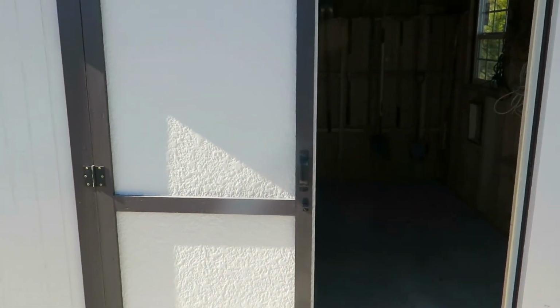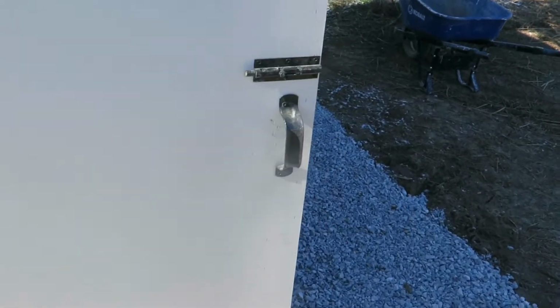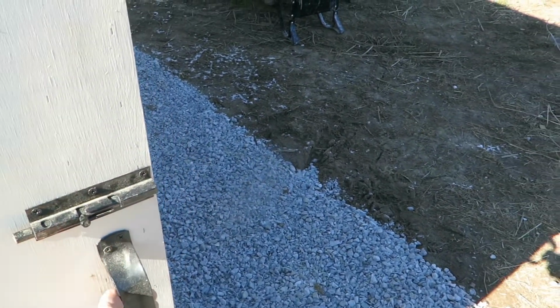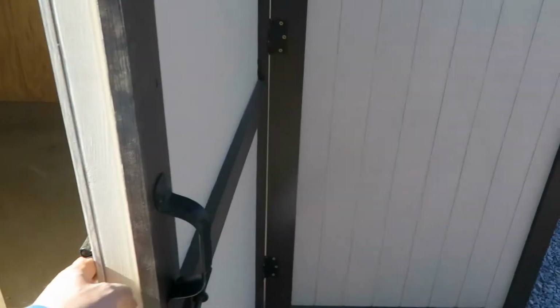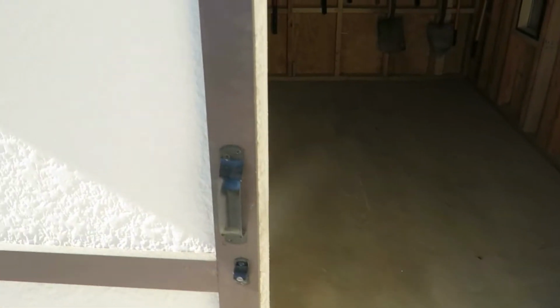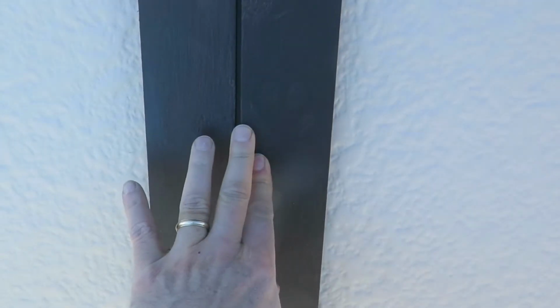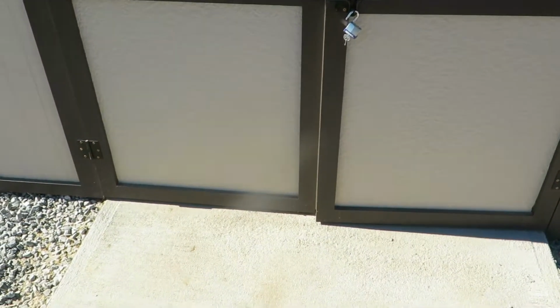And so this is what the doors look like. Oops, step over here. We're just putting regular 4-inch bolts on them for holding. And when you're doing this, one of the easiest ways is I made this door a little bit bigger and then allowed a 1/2 inch, so when this door closes against it, you can actually get an overlap and you don't get the air going in there or the weather. Again, I haven't got that pinned, but you can kind of get a feel for that.